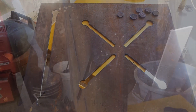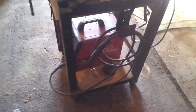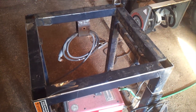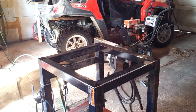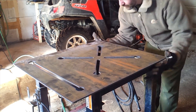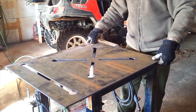So that's the finished plate with my little one-and-a-half-inch circles. Another look at my fantastic old welding table — it's not great, and you probably shouldn't have your welder underneath your welding table. There's a lot of dirt and dust that drops down and it's not going to do your welder any good, so that will be moving. I've just cleaned up the side of the two-inch square stock so I can get a reasonable weld on the side. I'll go ahead and fit the plate on top, making sure it's nice and square to the table, so the plate fits exactly inside the frame.